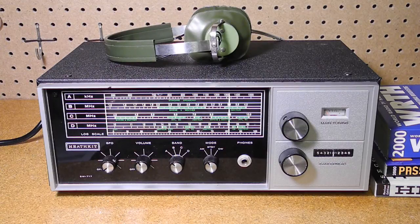It's a solid state design using transistors and was designed to be a replacement for their older tube-based GR64 receiver. The features and appearance are very similar to the GR64. It was not Heathkit's first solid state shortwave receiver — that honor goes to the GC1A Mohican, which I covered in another YouTube video. The successor to the SW717 was Heathkit's SW7800 in 1984, which featured a digital display and phase-locked loop design and was sold until Heathkit exited the kit market.